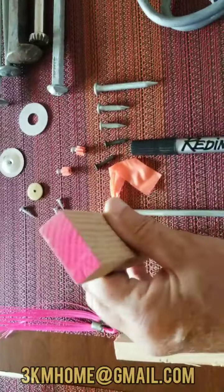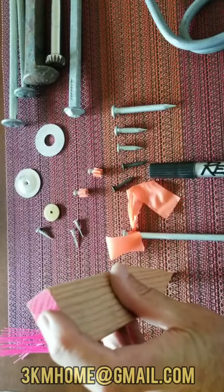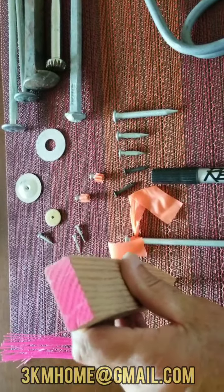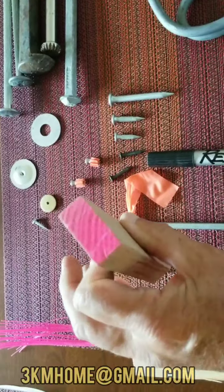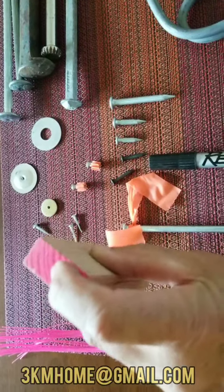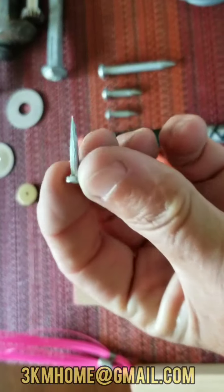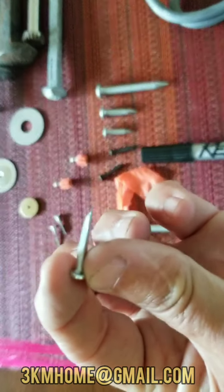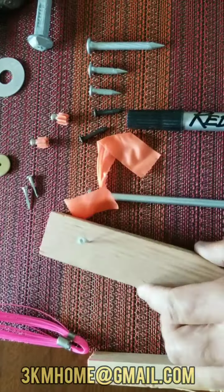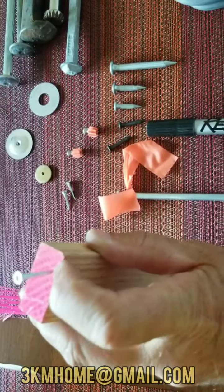This gets driven down into the dirt. If it was rough grade, since it's plus or minus a tenth, you don't have to tack it. If you did need to tack something, the wood gave you an area to place a cup tack — which is right here. There's a little barb on there that sticks into the wood, and you can hammer it in on top, right where the point fell. It usually didn't split it too much.